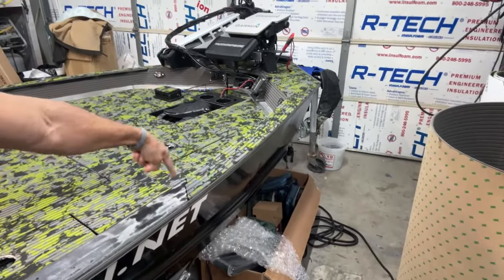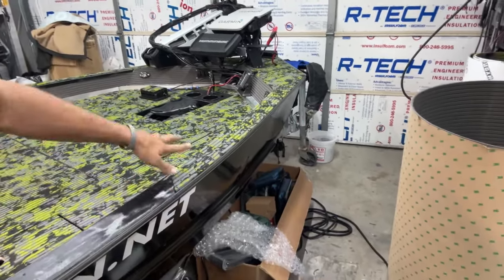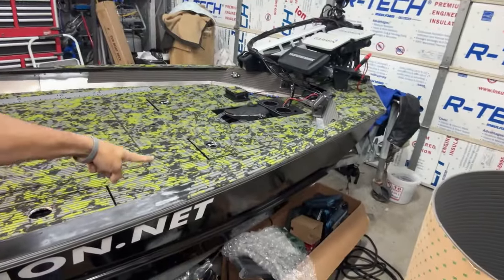Your most pliable time is right after application — I'm dreading finishing the gunnel seam because of this. The way you seam is: overlap the two pieces, cut down through both, and there's a perfect trace of the cut so they butt up together seamlessly. Because this has been on for so long, I don't know how it'll cut. The lesson: do it all at once if you can, or at least do the whole section at once.